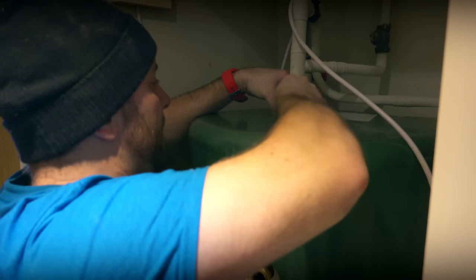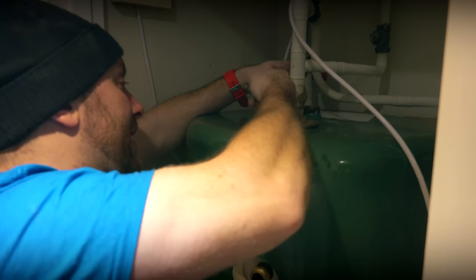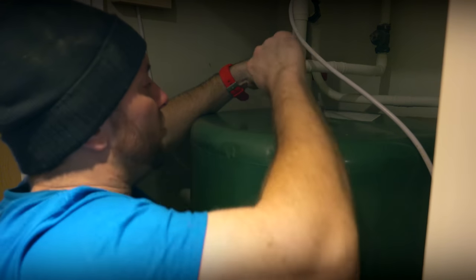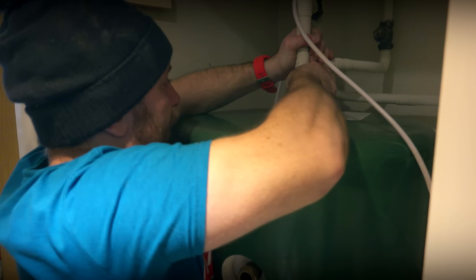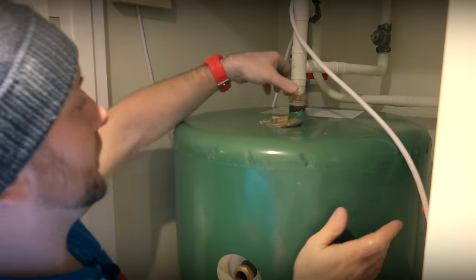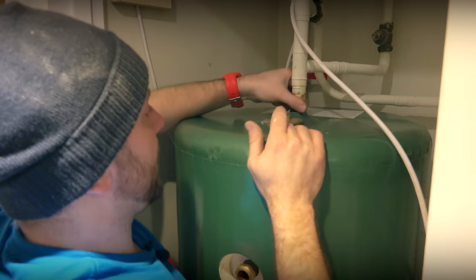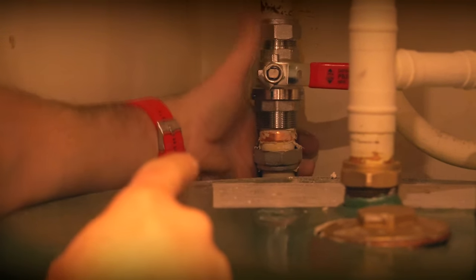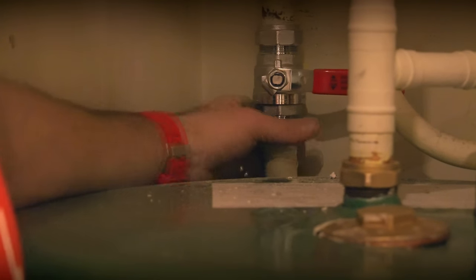Next up, once we've got that done I'm just going to get my nut and olive. This is actually going quite well — I haven't had to make many pipework alterations. We're jointing and compounding everything, making sure we're giving ourselves the best chance to get a really good result. So this is going to be the actual position of our tank. I just want to see how much compound we've put on that olive there, because we're at a position we can't get to very easily — if we have any problems in the future, it's going to be a right pain. So we want to get as much compound on there now, and then nip it up.